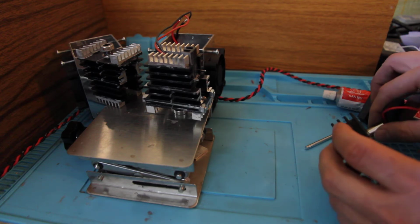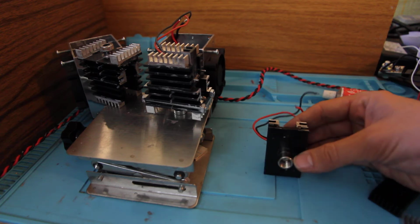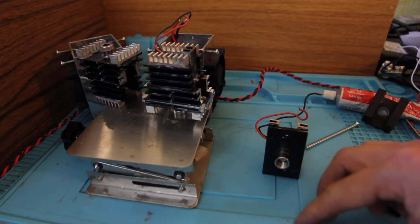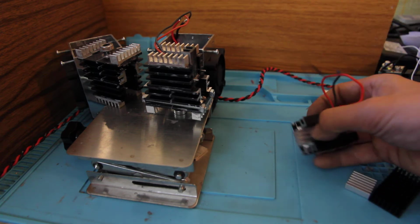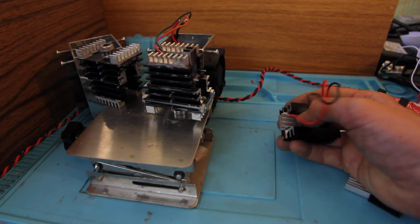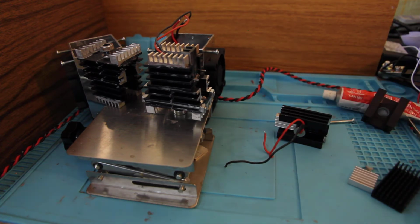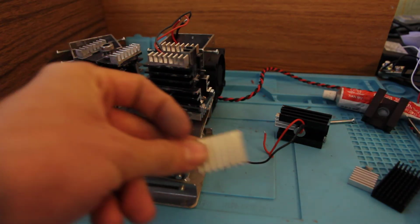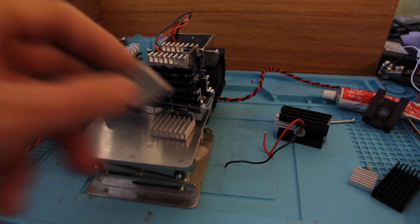So after all, we suggest that you can add additional smaller heat sinks that you can cover and add like this to your existing aluminum heat sink. So the more you have, the cooler the laser diode will be. I bought different shapes like this, so you can cut them. You can get something smaller and cut them as well.